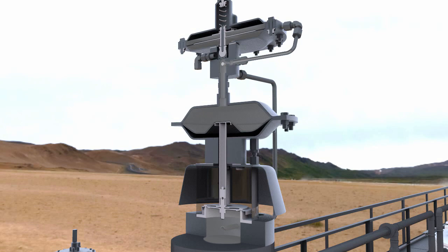Simultaneously, the pressure under the diaphragms of the pilot also increases. At set point, the pilot assembly will lift off of its seal and evacuate the dome pressure through the breather vent. As the pressure evacuates the dome, the main valve will open and relieve the overpressure from the tanks.